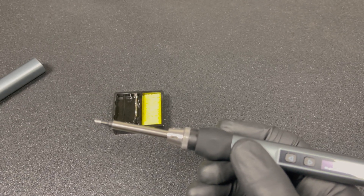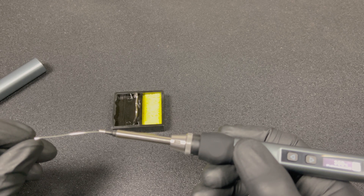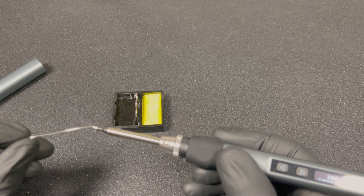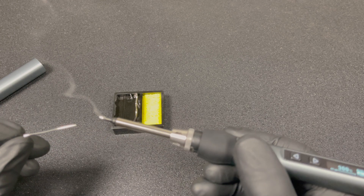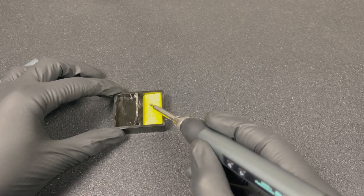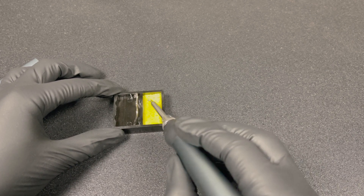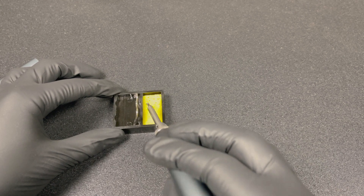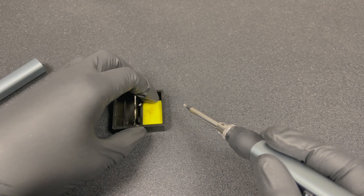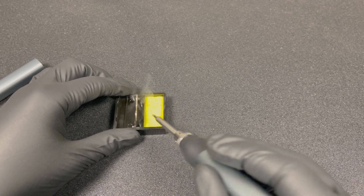It's stabilized now at 300. Now it's time to grab our solder and put a bit on there so it's not dry burning. The tip would otherwise start oxidizing and you don't want that. Just put some on both sides so it's well coated — nice little coat of solder and it's protected. And while we're at it, we can try out our little soldering iron stand with sponge. You do have to hold it because it's so light you would otherwise move it around. The sponge is just loosely sitting in there, but for a portable soldering iron kit, it does its job.